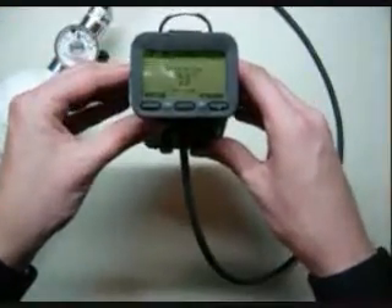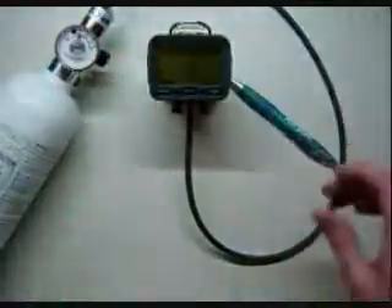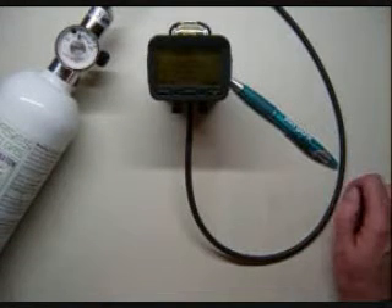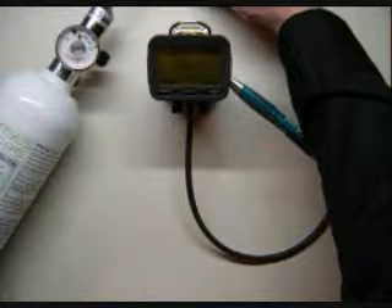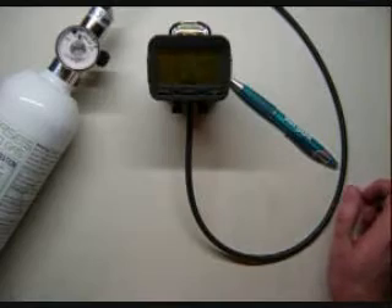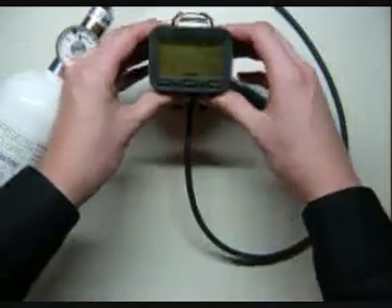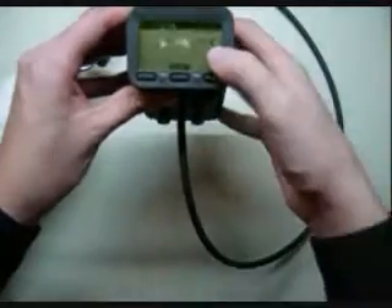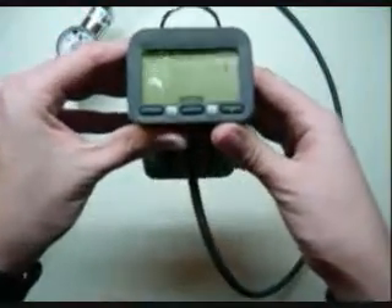The GFG goes through a 30-second countdown — it's now at 20 — just let it sit for this amount of time. A few things about tubing: there are a few different types out there — you'll see Tygon, Teflon-lined, and polyurethane. My favorite is the Viton. It's unfortunately the most expensive kind, but it works well with things like chlorine. Now notice there's a dash for the O2 — that means it's not bothering with the O2 sensor, leaving that alone. Over here we have the hourglass for the CH4, meaning it's actually calibrating the LEL sensor.